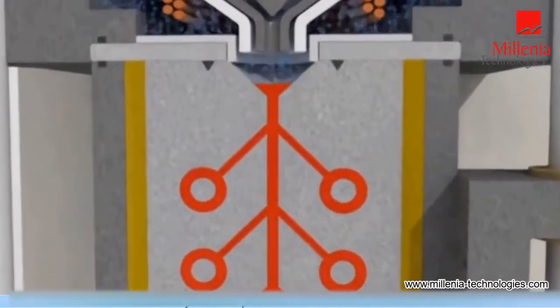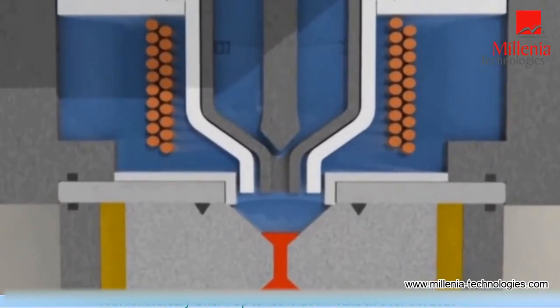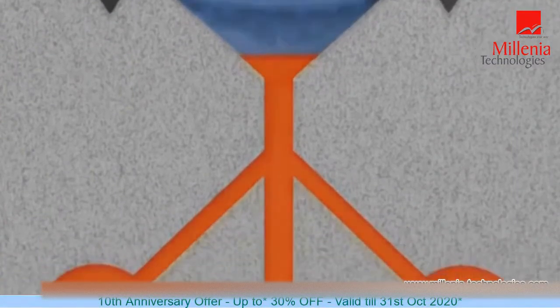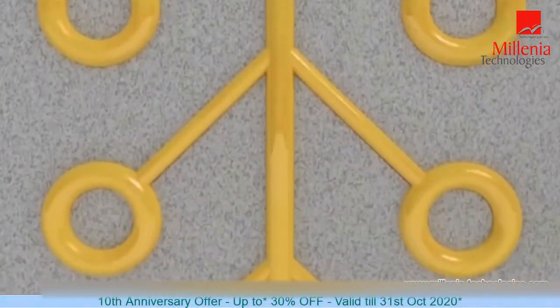This pressure, being applied to the molten metal, forces it into the mould while the vacuum pulls it. This results in a very smooth surface due to the effect of the vacuum, and a dense, well-compacted casting due to the overpressure, which benefits both thick and thin sections.